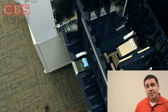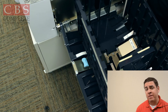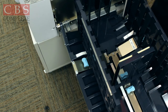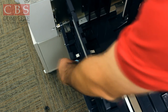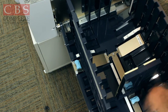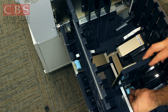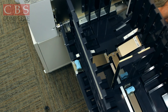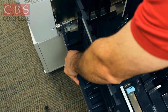Make sure you adjust your exit tray for the proper paper size. Keep in mind, the Duplo operates at 150 copies a minute, so it's a very fast machine and you don't want paper flying all over. Down here you have teal tabs — simply push and pull on these as needed. They're properly labeled for the paper size. If you're running 8.5 by 11, push your backer guide to 11 and your side guides to 8.5 and 8.5.